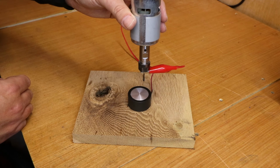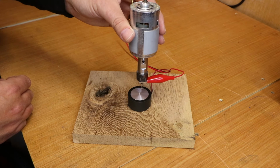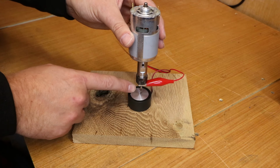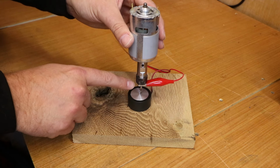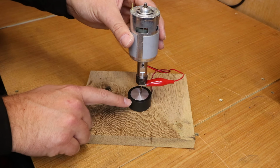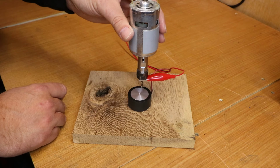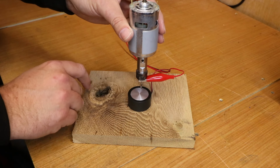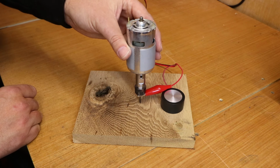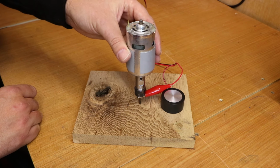The way it works is it will lower the spindle down very slowly and touch the top of that plate. At this point, it will remember the coordinate of the exact position. It will then add on the thickness of your plate. For ease, let's say that's 20mm. It will then know that the coordinate it remembered plus 20mm will equal the exact surface of your material once the plate has been removed out of the way.